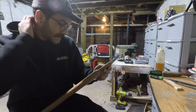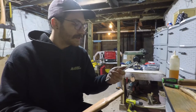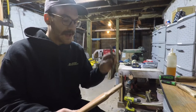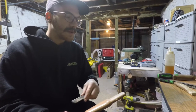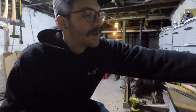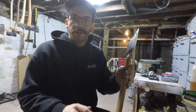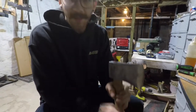I'm going to see where it made an impression — I know that's going to be a high spot, so I'm going to take a little material there. The best thing to do when you're doing this is baby steps at first. If you're new to hanging an axe, take a little bit, check it, take a little bit and check it, because you can't add wood once you've taken it away. The best thing to do is let it take time and enjoy the process.